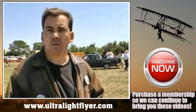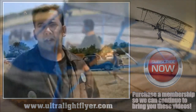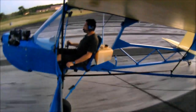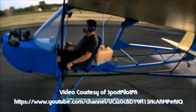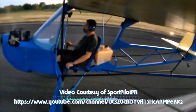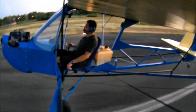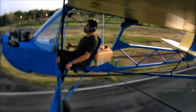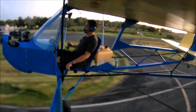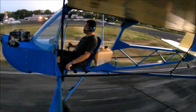How will the plans come? There are almost 35 sheets, I think 28 by 11 inches. Every fitting is full size — ribs, parts, everything is full size so you don't have to scale anything up. There's a complete builder's manual from A to Z with pictures describing every aspect of airplane construction. Even if you've never picked up a wrench, the plans will show you how to mark tubing square, how to drill tubing, how to deburr a hole — everything.